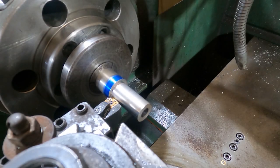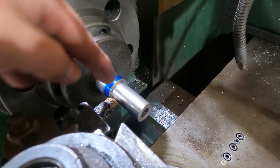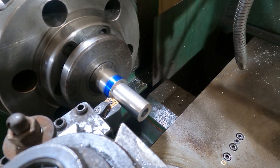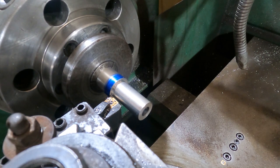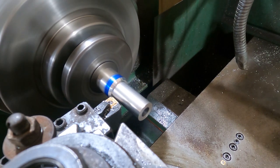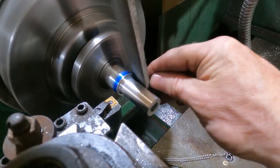I've set the compound to 30 degrees and we're cutting the taper on the inside end of the mandrel. This is where the compression rings will seat against, ensuring the ring is concentric to the mandrel and then concentric to the part when we finally machine it. We chip away at the corner little by little to cut our 30-degree bevel. We left a nice little step in there — just because it looks nice that way.